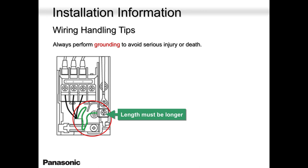Most of the time, guys are calling me: I have H11, guys. I have H11 fault. Most of the time, it's wiring. The wires have been crossed from 1 to 2, 2 to 3. But in most cases, it's 2 and 3 that got crossed. So as soon as you power the unit, after a few minutes, you have an error code. I swear upon God, the wire was not cut. The wire was not joined.